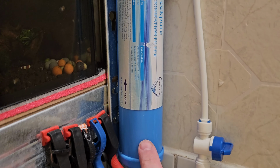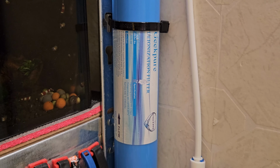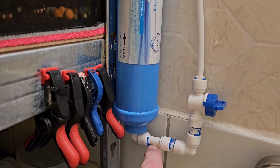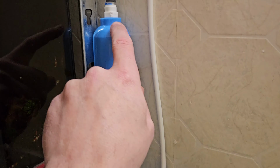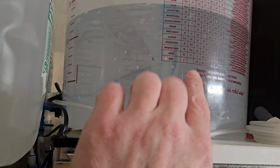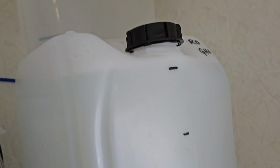and this gadget here is the deionizer. When it's shut off here, then the water with the 5 TDS goes in here, goes through it, goes up into my RO bucket. I have a floating valve there, and I have also a timer, so I know when to shut it off, but it will also shut itself off, to be on the safe side. That little blue thing is a submersible pump. It pumps the water up there, and I can pump it in this.